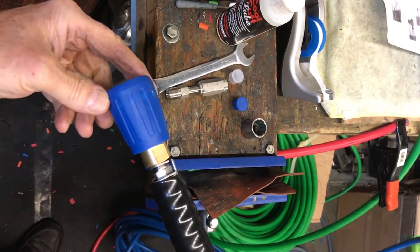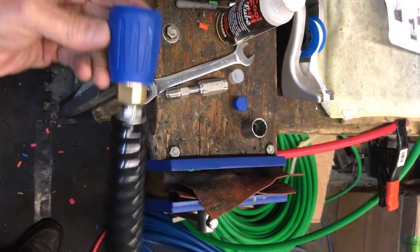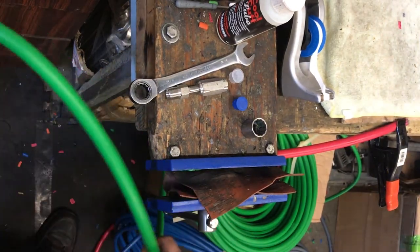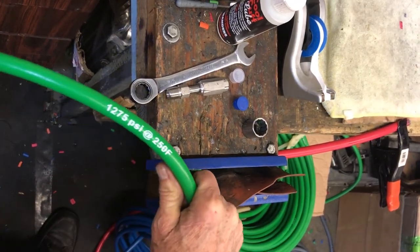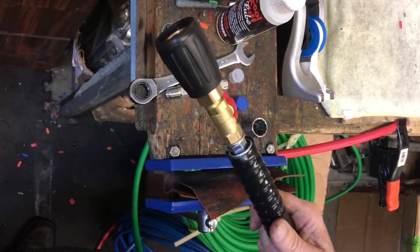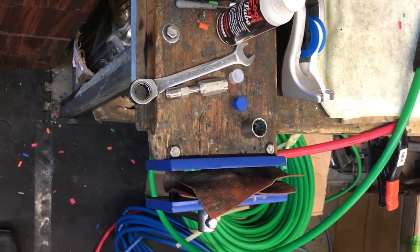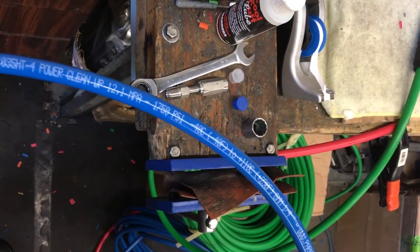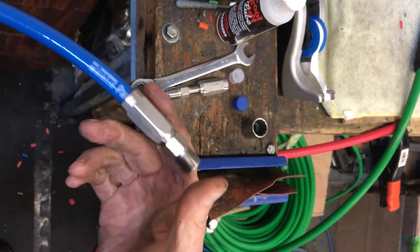Here's one — High Heat 3300, that's my top selling hose — just with a regular female QD with a blue cover. Here's some Cool Flex 1275 250, good carpet cleaning hose, Joe valve, female. And don't let anybody tell you you can't use gator crimps on Parker — Parker Parflex 1035 HT. It's a good hose, got a lot of memory, but it's a good durable hose. Definitely gator crimpable.